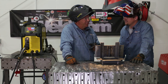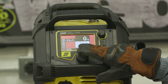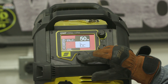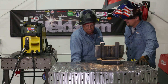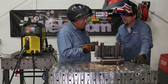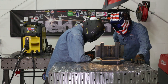Now I'm going to add 50% hot start. I'll go back to parameters, select hot start, and go to 50. How does that 50% work? It's going to be a higher value — I'm at 80 amps, so 50% of 80 is 40, meaning it should go somewhere around 120 amps for a couple of seconds and then it'll go away. But you should notice a much more active, hotter start. It'll be fairly quick, so watch closely.